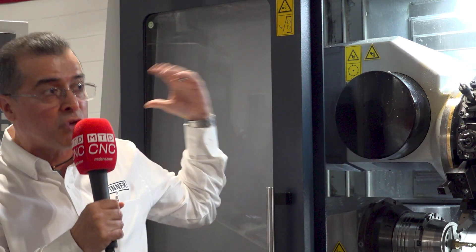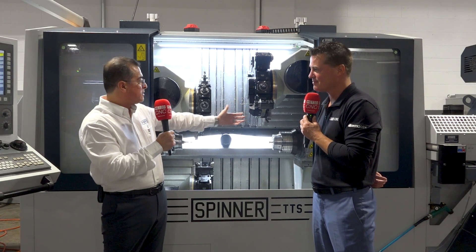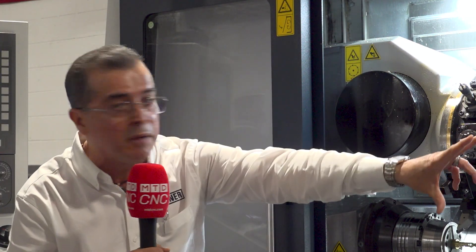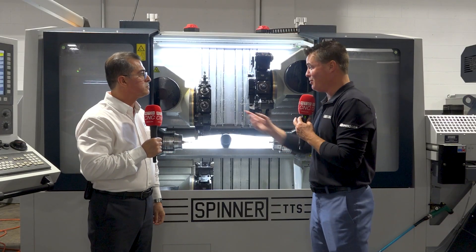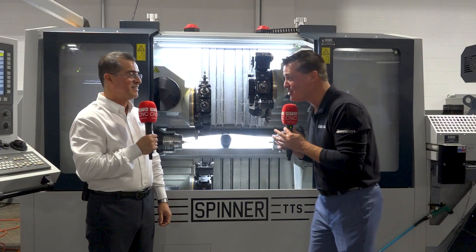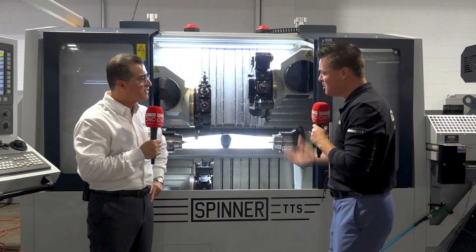You can have your raw material coming in from the left side, use a 12-foot bar feeder or bar loader — you can use a short one — but you're always feeding parts. On the right spindle, you're finishing the part, then your part catcher takes it and the part comes out complete, ready to be shipped to your customer. There are people still running with one turret going, 'I don't know what two are going to do for me — oh my gosh, there's three now, what do I do?' But the successes are there. Gain the confidence, get more done — that's where these machines come into play.